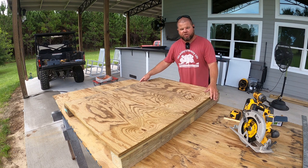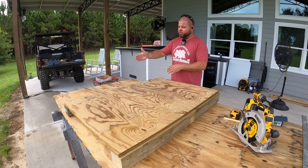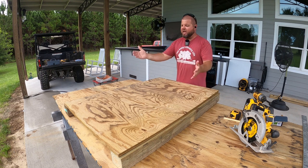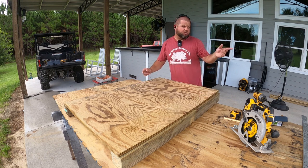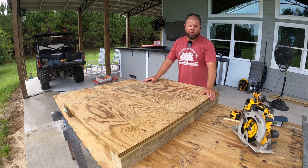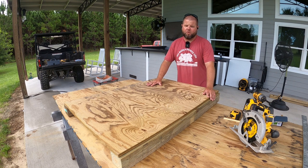I just cut a four-by-four from an eight-footer, which keeps this project really straightforward. I'm leaving the four-by-four sticking out on either side by half an inch. Those two 32-inch sidewall pieces will be attached to the back, hinged so everything lifts up. When it comes down, the sides need to rest on something — a full-length four-by-four gives the whole doghouse full support and makes it really strong. I want those sidewalls to barely hang over the four-by-four so water sheds off the sides and goes to the ground. This pressure treated wood is not the old arsenic-treated type, so there's no real concern for the animals.